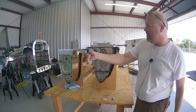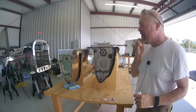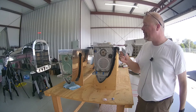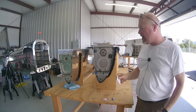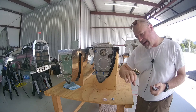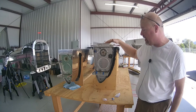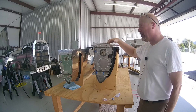I think we're good to go on one tank. Then it's about checking the other tank — the work I had done underneath where I didn't seal it correctly. In a previous video I showed where I was doing it by hand — it looks like crap but it works. I'm going to put my scope cam back in there with a syringe of sealant and get up in there and finish filling all that in, then do my testing on that one using just water. So we're a couple steps behind on that tank. This tank I think is in a good place, unless the fuel test tells me otherwise.